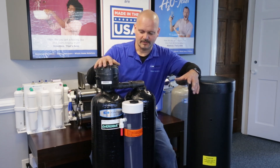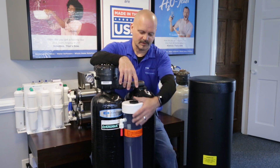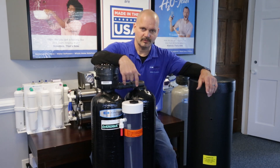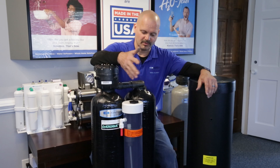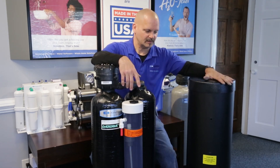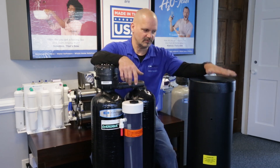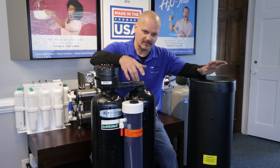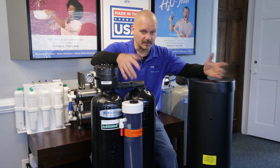The unit comes with two different options for the reservoir. You can go with the clear one, which front-mounts and piggybacks onto the unit — that's a great way to go if the unit is in your garage where you'll have eyes on it and can see if it's low on peroxide. The other option is the bigger black tank, which you can't see through. The clear one holds about two gallons; the black one holds about 12. Unless you need that extra capacity or it's in a place you don't look at often, you could really go either way.